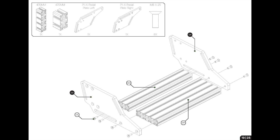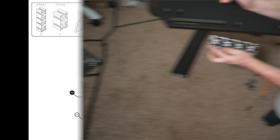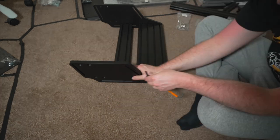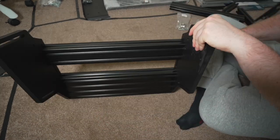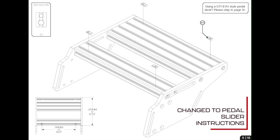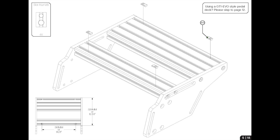Welcome to page 19. Here we have two bits of aluminium profile — one two-slot and one four-slot, both 470mm. Take two P1X pedal plates, left and right, and secure them in place with 25mm M8 countersunk bolts on each side. Once this pedal plate section is constructed, we're going slightly off-piste to the Simlab pedal slider instruction manual for more adjustability with the pedal position. Between the front and back bit of aluminium profile is 326mm, and the distance between the holes of the M8 T-nuts is 361mm — follow this carefully.